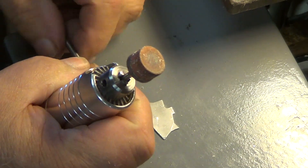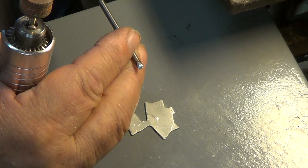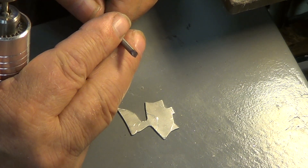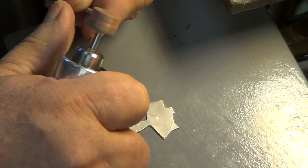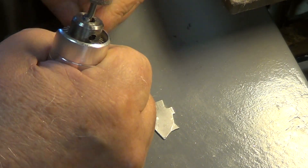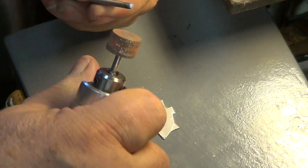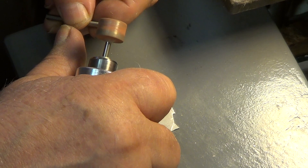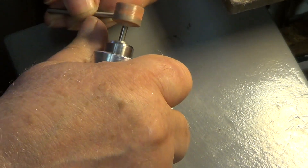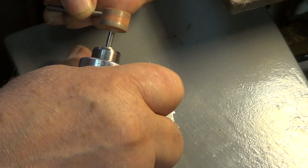This is not tempered to a hard surface — it's just hardware store steel. I think this is oil-hard; green is water-hard and red is oil-hard. This is three millimeters and I just cut a piece off. The first thing you want to do is just curving — you start from the edge like this, start right here, and start curving. Then you want to convex the other side, so if you have a blade you can resharpen it. Now if you're going to use these a lot, it might pay to temper them hard — that's a whole different video. These tools will last a lot longer and you won't have to sharpen them as often. But you will need a grinding stone to do it.